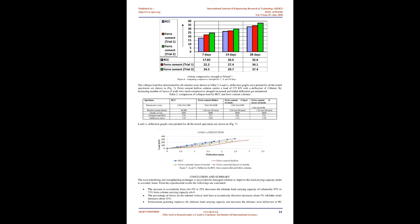Proper curing is necessary to develop the required strength of the mortar. A curing period of 28 days is suggested. However, at least curing in the first 2 weeks is essential and should start 24 hours after final application of the mortar to avoid shrinkage cracks.